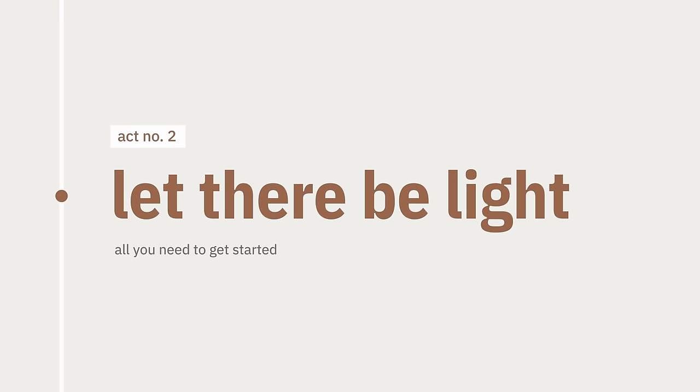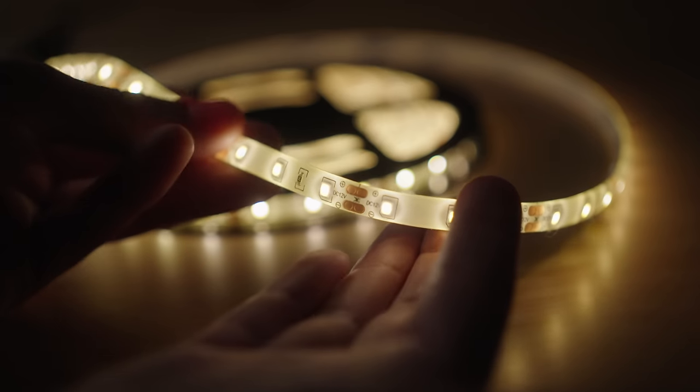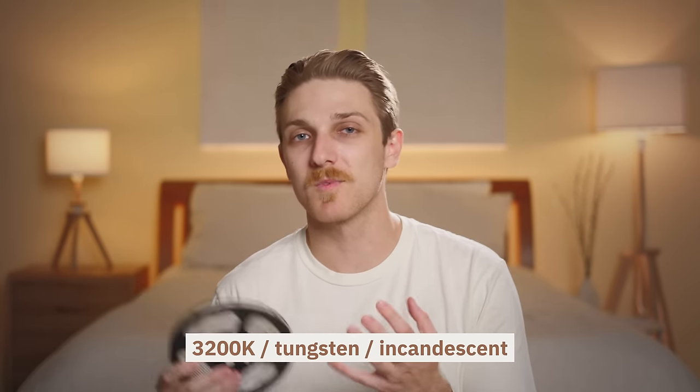So to recreate this, let's enter the world of 12 volt light strips. Act two: let there be light. Technically, all you need to get started is just a strand of LED lights like these — as any college student knows, they're very affordable. But my recommendation for interior design is don't get RGB colored lights, because even if they offer a white mode, it's not going to look as nice as a strand built around white. Look for 3200 Kelvin, which is that really nice warm tungsten color that's still not orange. They typically come with an adhesive backing, so you may have hidden places around your house where you can just rig these up, like behind some furniture or underneath a kitchen countertop.